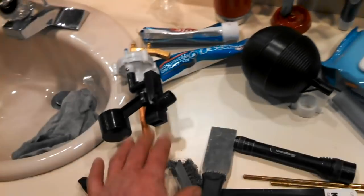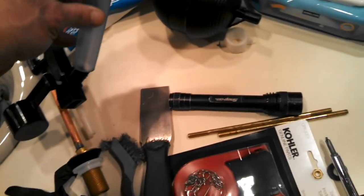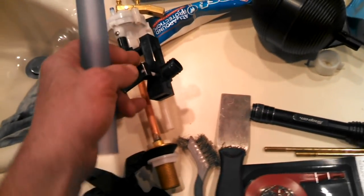The flush valve is installed — you can see the black gasket is slightly compressed. If the brass tabs fall off and drop into the bowl just fish them out, and make sure you're always screwing in, not unscrewing. Next, install the fill valve. First put the refill tube onto the fill valve, supporting the body with one hand since it's brittle plastic. Thread the other end of the tube into the hole in the front wall of the tank — that supplies the water that swirls and fills the bowl after the flush.